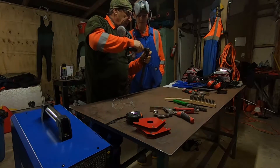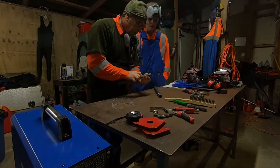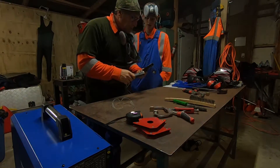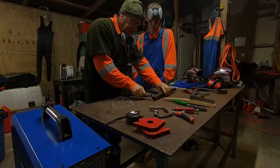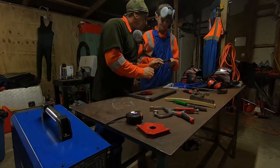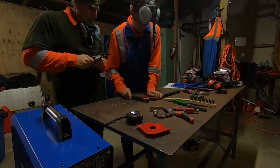So when you weld that you've got a bit of a place to weld — you see you've got a groove there. So you're going to start on... Did you clean on three sides of it? No, not one side. Set it up as a square — you've got your magnetiser. Where's the square? The hammer's there to make some fine tuning adjustments. Use your hammer — put the square on it.